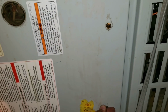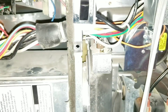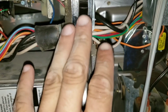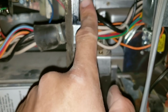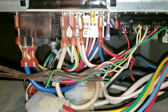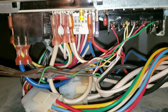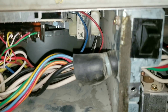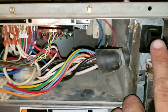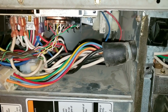There are two screws on the board and we're just going to remove them. Once you remove those two screws you should be able to slide out both panels. Once you remove the two panels, this is your safety switch right here. When engaged, it turns your system on to your board. Then once I remove my finger — or remove the front panel — that will kill any power to my board. I'll engage it for you so you can see it.